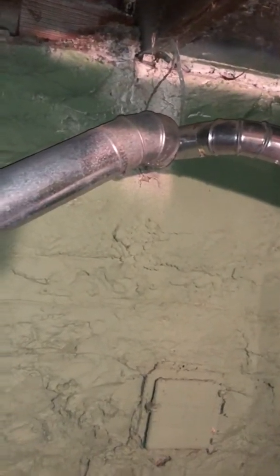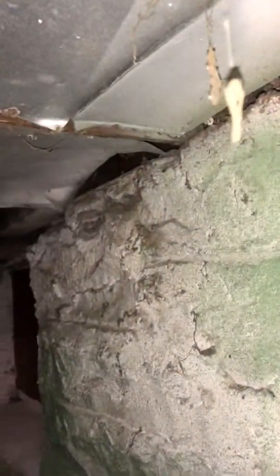The second thing: he needs to get an open filter rack, and this return duct is too small, so this piece of duct will have to be replaced right here. If you look closely, he's got huge openings in the return — huge holes — so that needs to be fixed.